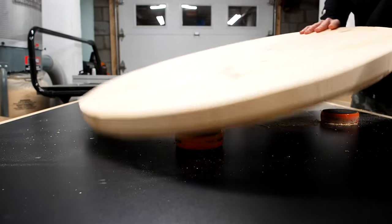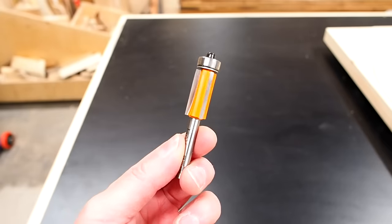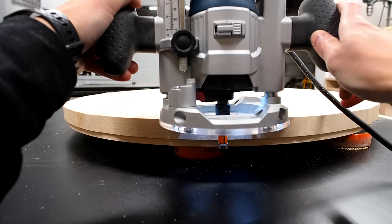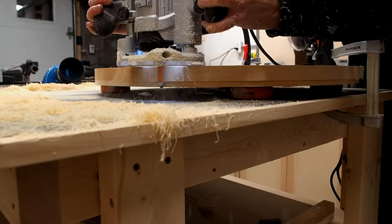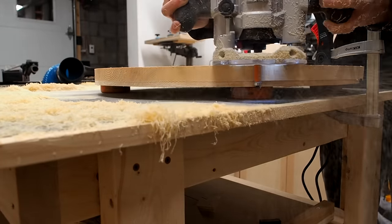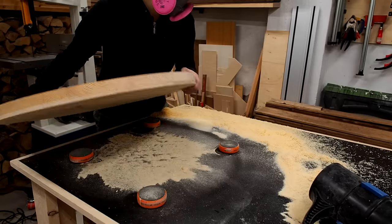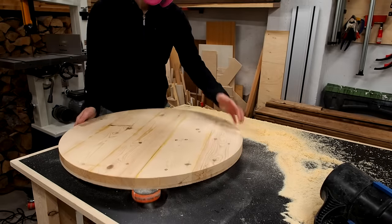To do this I'll flip over the circle so that the lip is on the bottom. To shave off the excess wood I'll use a CMT flush trim bit. I lined up the bearing with the bottom lip which will serve as my guide, and with that setting locked in I went around the circle counterclockwise. I made progressive shallow passes always right to left until the bearing bottomed out against the wood. Eventually after several passes I was left with a perfect circle and a huge mess.